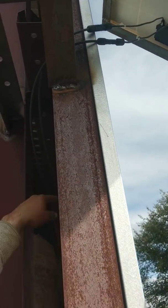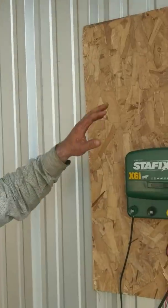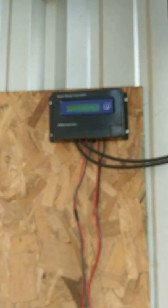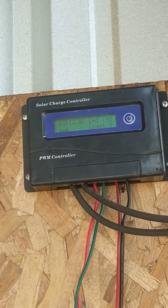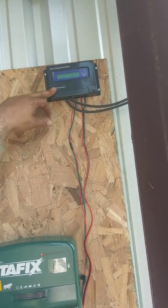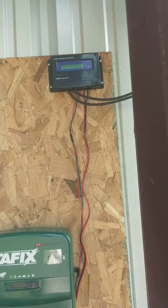We had to buy an extra cable to reach in here to what is the solar charge controller. This is the charge controller, which regulates how much power is sent to the battery and to the fencer, so that once the battery is full it quits charging so as not to ruin the battery. It gives a readout on how many volts, and it's got a power switch to turn the load on or off. One important thing: you want to make sure you hook your battery to the charge controller before you hook the solar panel. They said there's a fuse in there that will blow that's really not replaceable.